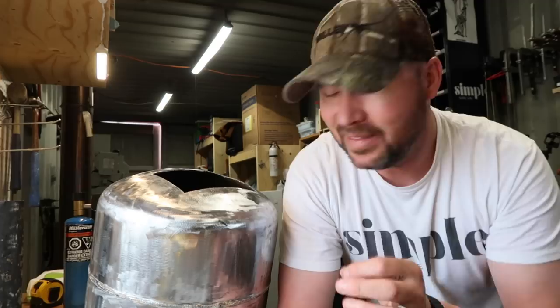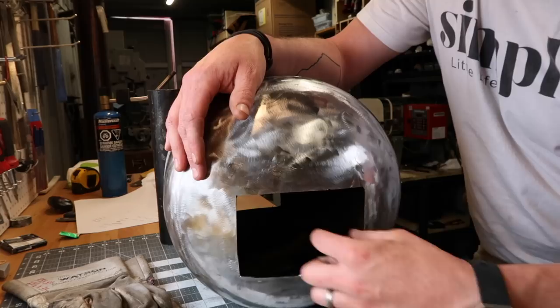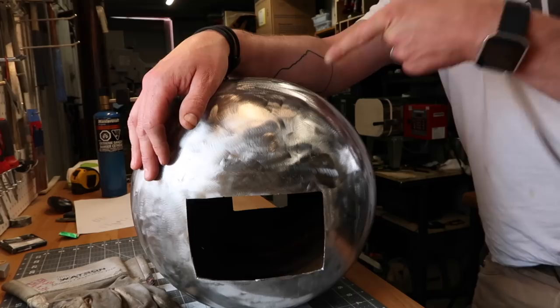Also, first of all, thanks so much for all the great input and all the super advice you guys have been giving me. Really appreciate it. We're gonna do a circular chamber, so I'm gonna do 2 inches of Kaowool on the inside of this, and from the comments that you guys have left and doing a little bit of research, I guess the best way to come in with the burner is at an angle like this.